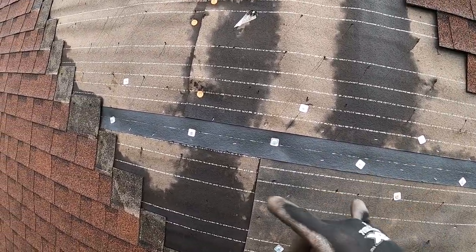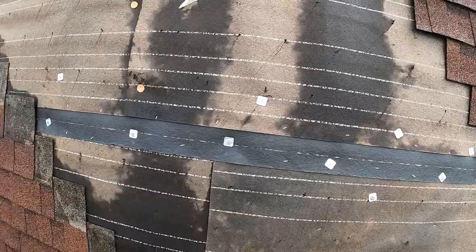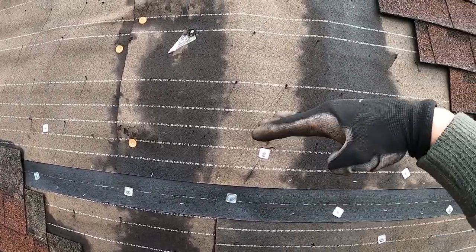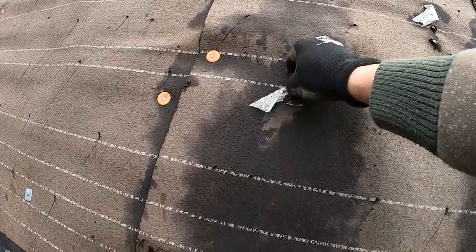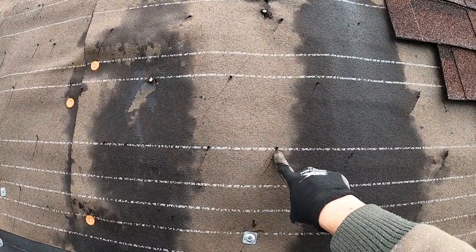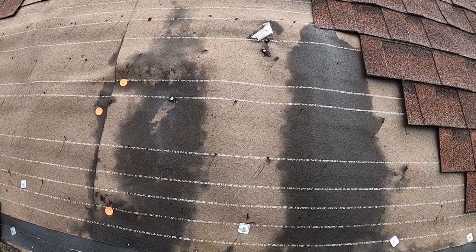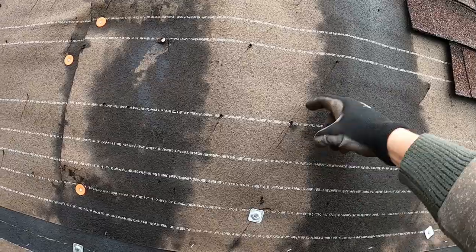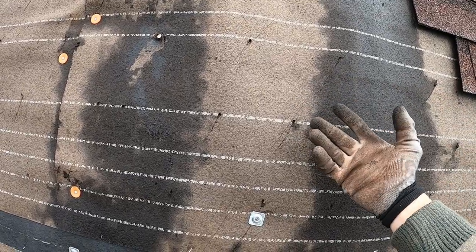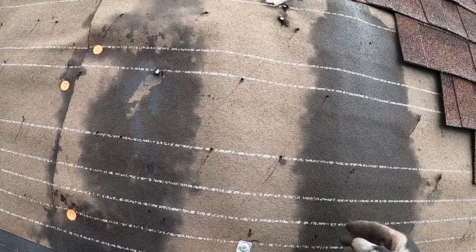Okay guys, so we got our strip in, we got it tacked in place. We used the metal cap nails with a few staples in between just to secure it a little bit. And we are also moving up into the next sheet, getting out those bubbles again with the metal cap nails. Now, little issue I should cover, just so you guys know, for repair purposes, these holes are gonna be okay. It's an old roof. We have the asphalt shingles that are covering those, so that's going to waterproof. And if any water does happen to penetrate those asphalt shingles, it's probably not going to get in those holes. Even if water does flow over that hole, this stuff resists and repels water enough such that you're barely going to get any water in there, and it's really not going to be an issue.